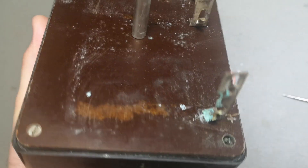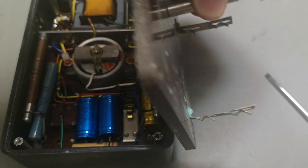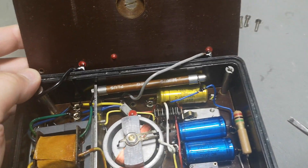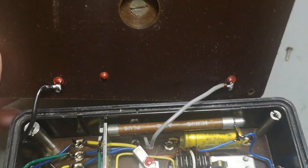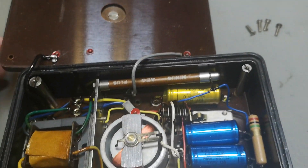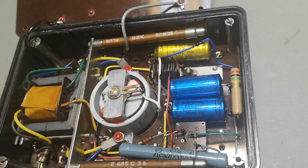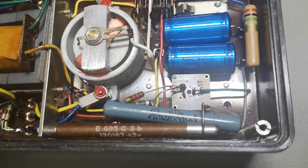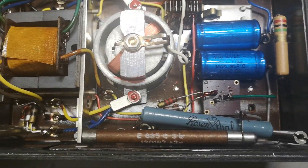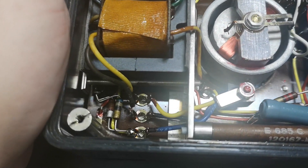Hopefully I can get in here and see what else is in there, and at least it seems to be working. That wasn't as bad as it looked — we've got some wires so I'll go this way. I actually thought the two batteries were in series with a center tap but that is not the case, so this will be the nine volt input. I can see the two diodes — the two brown ones — in a push-pull configuration, and those will be the two transistors.